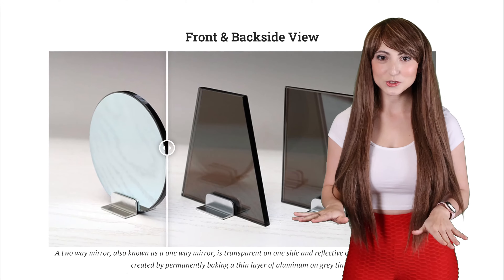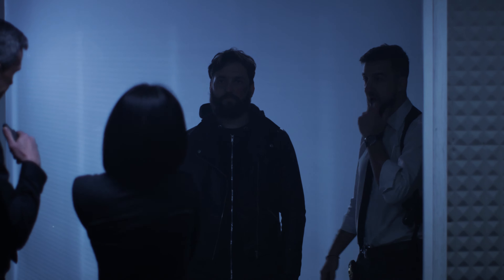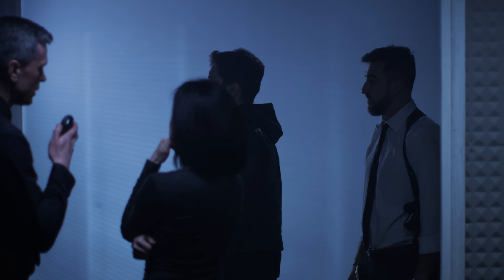So, how does a one-way mirror work? Here's the glass substrate and the mirror coating is on the right side, facing the room that you want to be mirrorized — that's called the subject side. The other side is the observation side, just like in the movies where there's a police interrogation. On the observation side, you turn off the lights, while the lights are turned up on the suspect side. This creates a ton of glare on their side, making it impossible to see through. For maximum privacy, the mirror side should be eight times brighter than the non-mirror side. If it's less than eight times brighter, the suspect might be able to see shadows through the mirror.